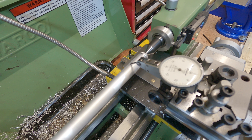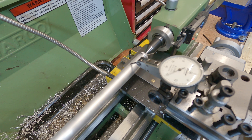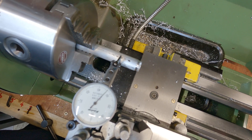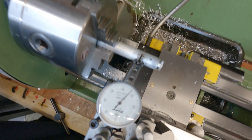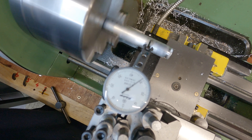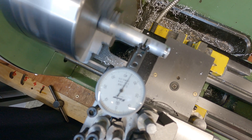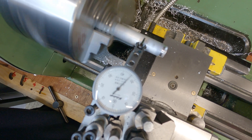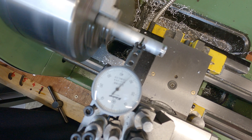...about 0.2 millimeters of run out. So now I've got this set up, it's a really easy way for me to dial in any run out on my lathe, especially when using a four-jaw chuck. I just want to quickly show you — by moving the stock that I've got in the lathe further into the chuck, look how much it reduces the run out. That run out there is about 0.05 millimeters — so much better than when it had really extended travel on the stock.